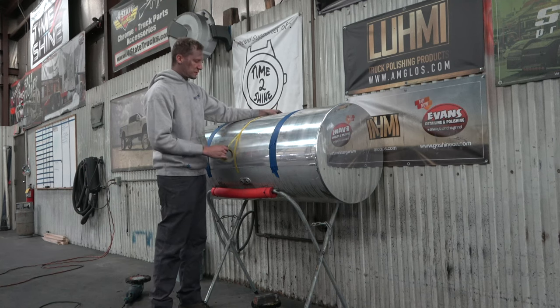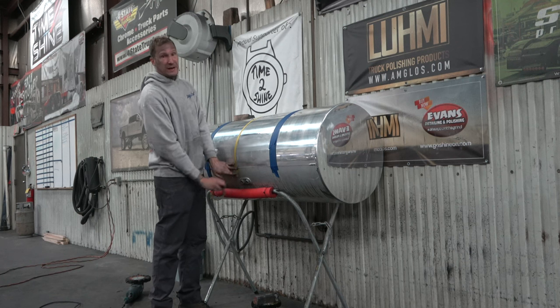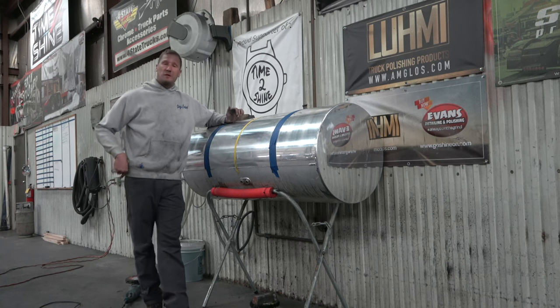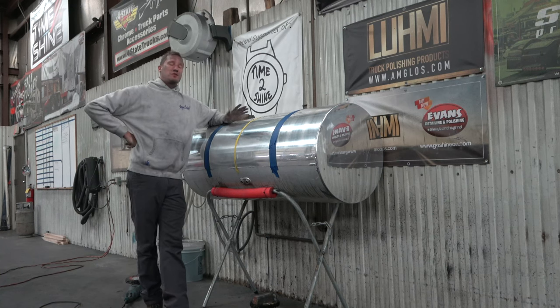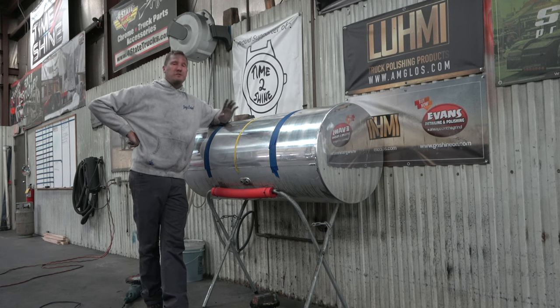Orange and brown first, and then we will do yellow and show brown, and then on to regular and yellow and regular brown. Now, why are we going to do that? Because I want to show everybody that your hash marks will be less with less cut. So if you're cutting with orange and brown, you're going to have heavy marks to work out. I don't care what buffs you're using, what compounds you're using, the softer you start, the softer it finishes.